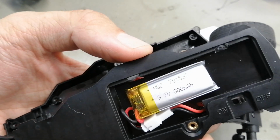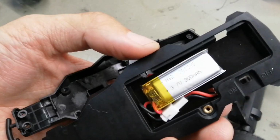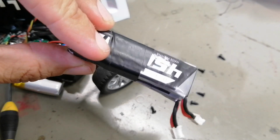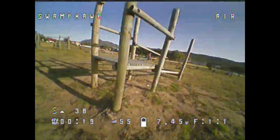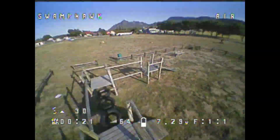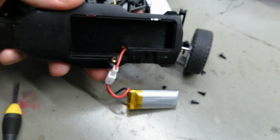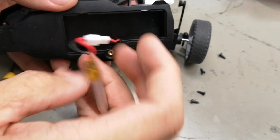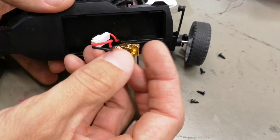Wow. Okay, so that's all the battery that's in there. It's a 1S 300 milliamp. That's pretty impressive that it gets this kind of runtime off that battery. These are the two batteries that came with my Emax TinyHawk FreeStyle, which is an awesome drone. I'll put a link in the description. You should probably just buy one. It looks like they are definitely designed to fit in. Obviously this is only 1S, I've got two strapped together, but that would be even more runtime. Presumably this is a much slower or lower discharge LiPo, hence its smaller size.